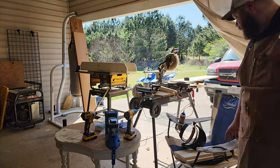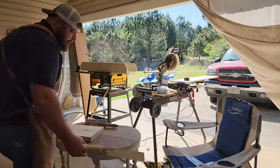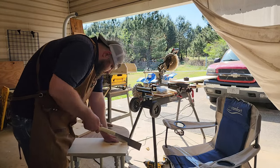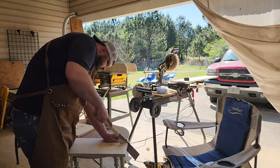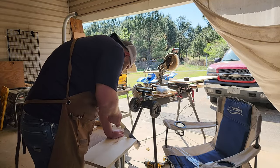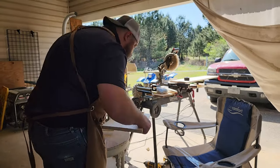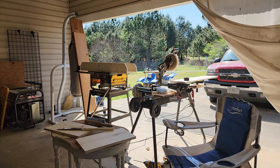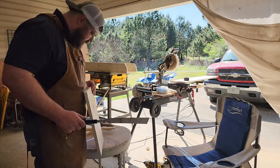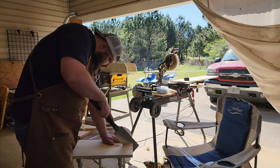I get all the Kreg work together and set it aside. Now I do my drawings with the triangles using the speed square. I didn't have my jig saw, so I was stuck using a Japanese flush cut saw — also called a Japanese razor saw. I love these saws. I didn't realize I was using the cross cut version when the motion I was going with the wood grain was actually a rip cut, so I should have used the rip cut saw. I went and got the rip cut one — I struggled for a few minutes before realizing I was pinching the wood back against the blade, but once I got that cleared up I went right through and it cut like butter.